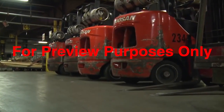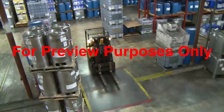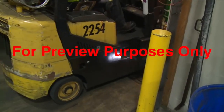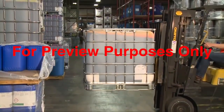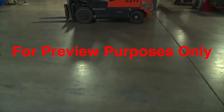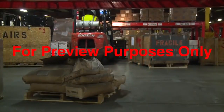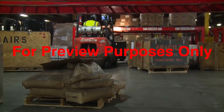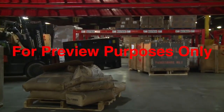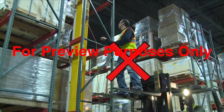Contrary to what many people think, driving a forklift is not like driving a car. Forklifts have different controls. They are heavier than cars. They steer with their rear wheels, and they are naturally unstable. Forklifts are designed to raise, transport, and lower heavy loads. Because of the counterweight it carries to balance these loads, a forklift can weigh twice as much as an automobile. Forklifts have also been designed to get in and out of tight places easily, so they have a very narrow wheelbase. This all means that forklifts handle in a very unique way. And when they are mishandled, they can be dangerous.